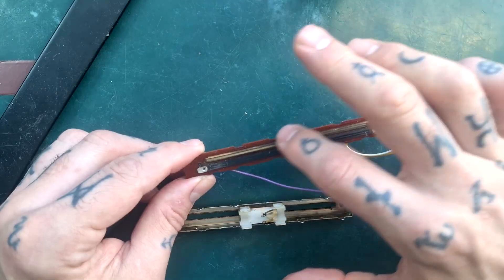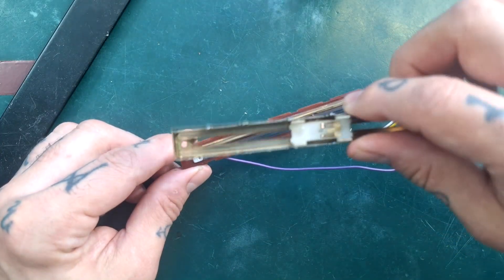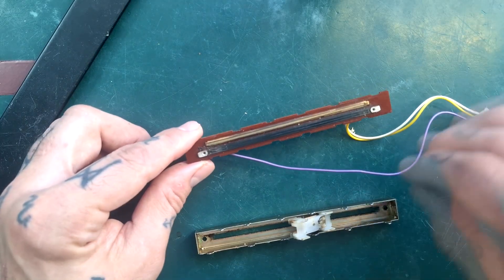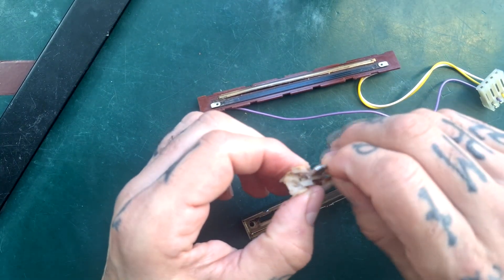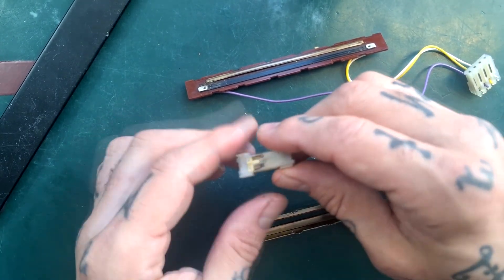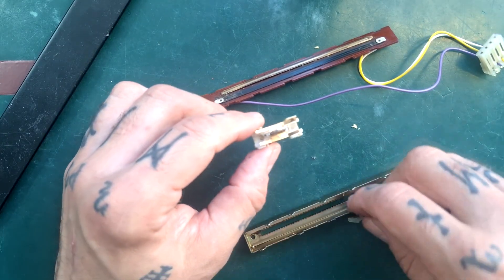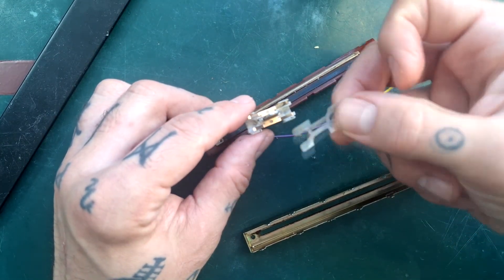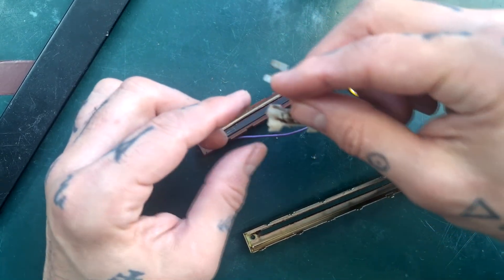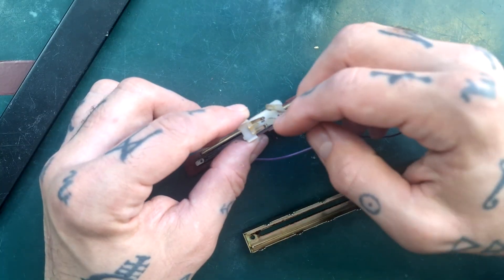You've got a common connection to circuit ground, and then depending on how far up or down the brushes on this moving plastic slider are along the strip, the resistance will change. Here it's typical to have a spring — this brass spring that maintains contact between the brushes below and the conductive parts. That will often be separated from the metal casing by a little plastic washer. The metal pin that goes into the plastic knob on top is usually set into a plastic shoe, and the brushes are attached to that below.